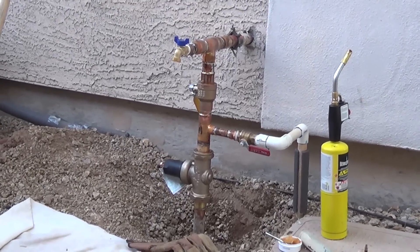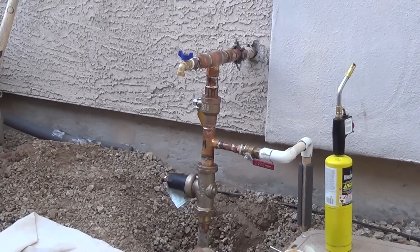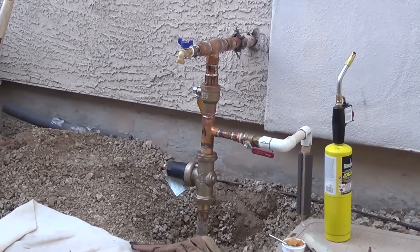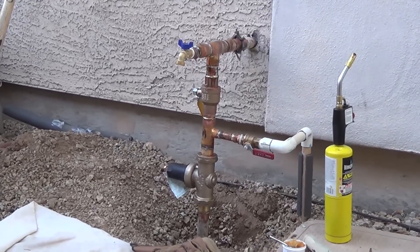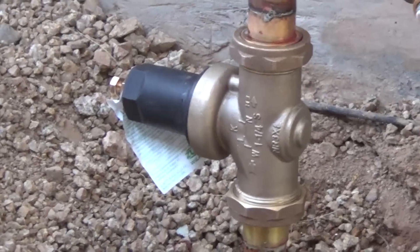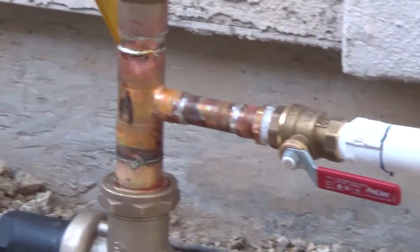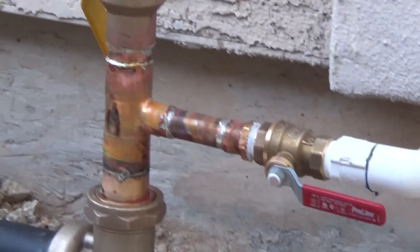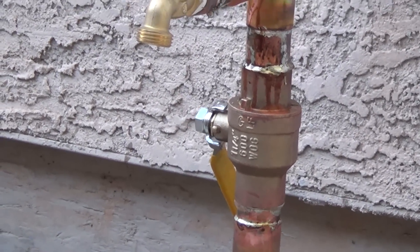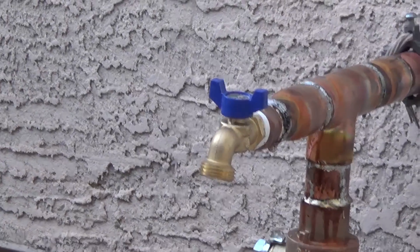So here I am at my sister's house — or is it my brother-in-law's house — and we've got everything back together now. I didn't do a video as we were doing it because, believe it or not, this actually took us like six hours. Here's what we did: that is the pressure reducing valve, and we have it going into a T, coming over here to the sprinklers, with a shutoff valve there. Coming up to another valve — that's the secondary main since the main is out by the street — then a shutoff going into the house, and your spigot up there going into the house.